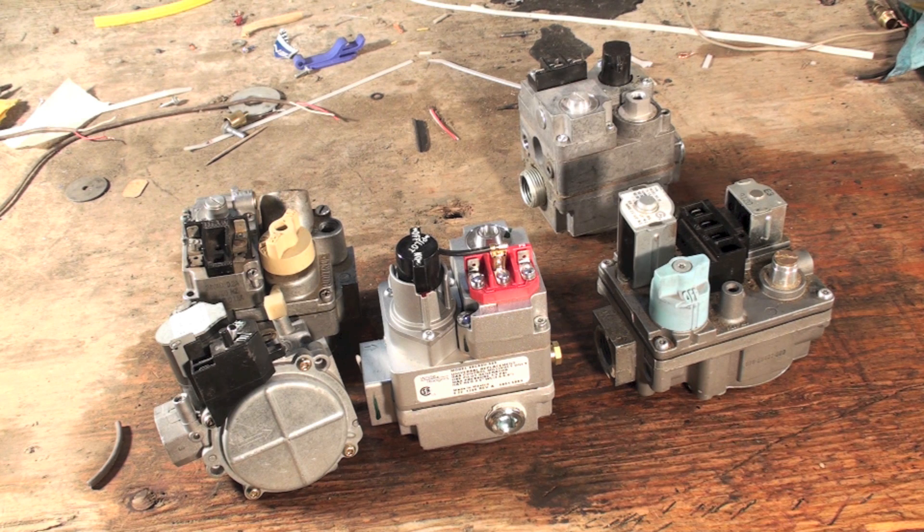So that's how you do these valves — just again, make sure that your gas is off. The pressure's not real high in this gas line, but it'll definitely burn and you could have a big fire. So anyway, that's the pressure taps for checking manifold pressure and inlet gas pressure on the gas appliance.